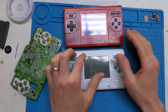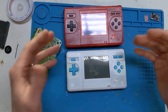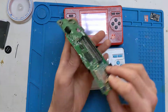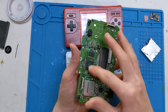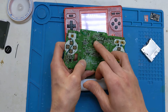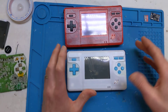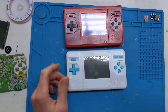It's what I use on my screen switching mods for the DS Lite ones. I'll write a blog post with the proper locations of these two test points. They are fairly easy to get to. I even took the DS slot off here to try and see if it's on the rear. I was hoping it wouldn't be, and I did actually trace it to two points on the processor, but these ones are working fine so there's no point going even smaller — the vias underneath the processor are really tiny. But yeah, as usual, blog post with the proper descriptions. Thanks for watching. Bye.